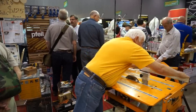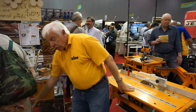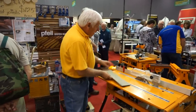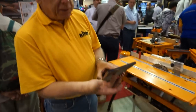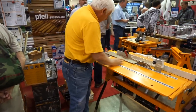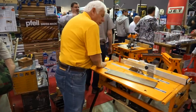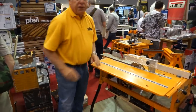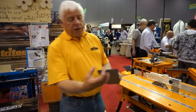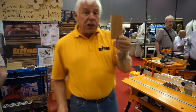This is probably the safest way possible to cut a piece of timber. To demonstrate: I want to cut this piece of timber to about 120mm wide, taking about 40mm off. I set the rip fence to 120mm and lock both ends in. Now I can run that through quite easily. If I then want to work with a very small piece of timber — say cut it at 30mm — that's where the safety features become really important, because you can see how close your fingers would be to the blade.